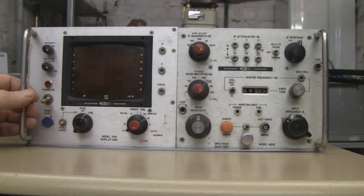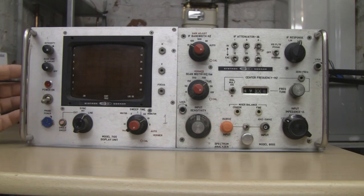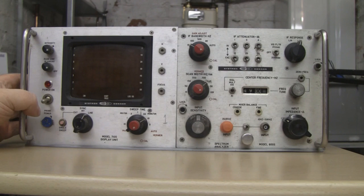When you get something like this and you're not sure of its history — especially without a schematic — you want to spend quite some time looking around the unit, lifting all the PCB boards out and taking a close look for any scorching or modifications somebody might have made trying to fix it. This is especially important because it uses some high voltages inside, as it has a vintage tube-type display.